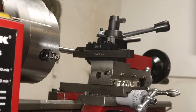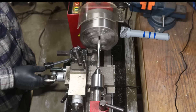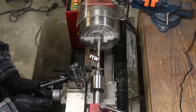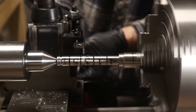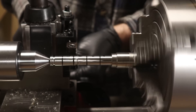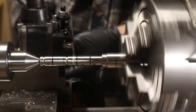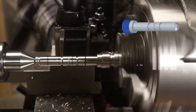But now we're really in trouble. It's time for the parting tool and there is no way that this will work out well. I'm referencing this shoulder, then moving to the end of the part to make a groove for the hacksawing later. Then it's time for the o-ring grooves. It isn't cutting per se — I'm more forcing the tool into the material until there is enough pressure to take a cut, suggesting it to take a chip with more and more pressure. It's very hard to get a good result and hit an accurate dimension. But let's move on and cut the thread.